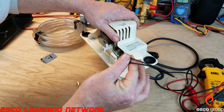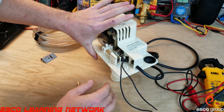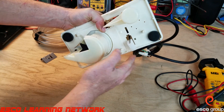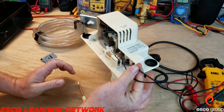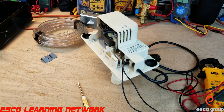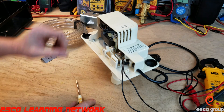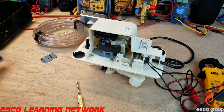In the front here we have a normally closed switch. This is wired into a low-voltage circuit, and if for some reason the water wasn't draining from the pump, a secondary float on the bottom would open this switch, opening the low-voltage circuit. Some people wire this to the R circuit, some to the W, some to the Y — it all depends on what type of appliance you have and your control scheme. Most people break the R circuit to shut down the appliance.